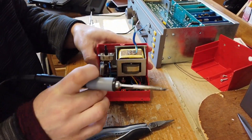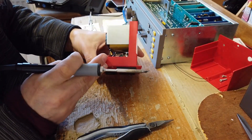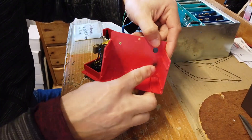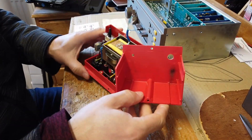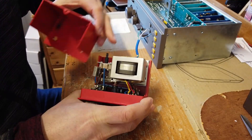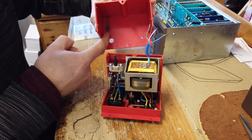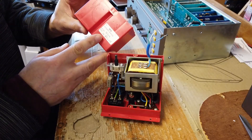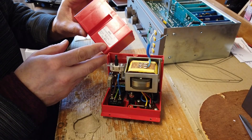Let's check all of those connections are looking good — they are. Let's have a look at other connections in here — they all look like good solder joints, so this looks like it's going to be a success. If you have a look here, you can see where the snubber capacitor has previously failed, because that is indeed in line with the snubber capacitor. The switch lines up with this hole here, and you can see where the old capacitor was — it's clearly left quite a dark mark inside the housing.